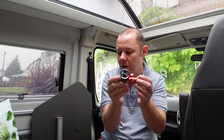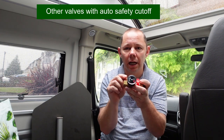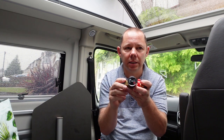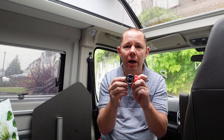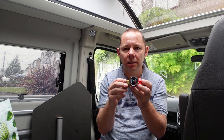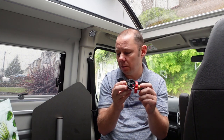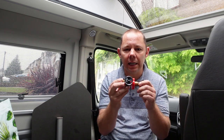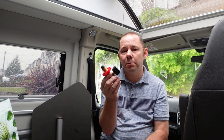The reason I mention that is another one out there — they all say they have a safety cut-off, so if there's a serious gas leak it automatically shuts the valve off, which is great on paper. But there are lots of reviews on forums where the valve doesn't always reset fully, so you end up with less pressure on your gas than you would with a straight-through pipe. Some people swear by them but I know a lot of people who find them a problem and they cause issues with gas appliances.